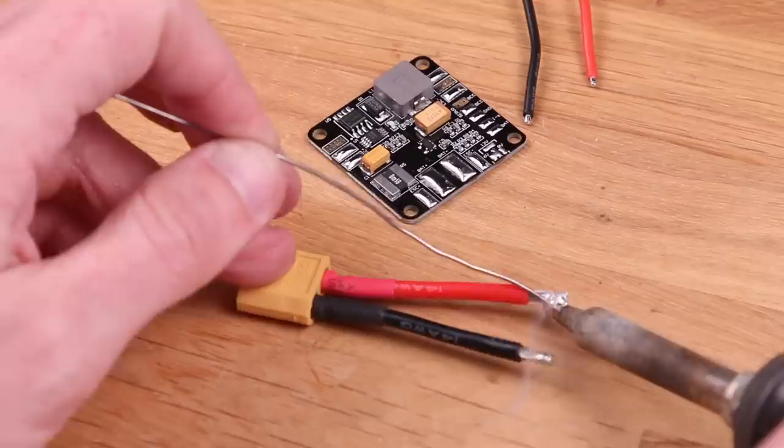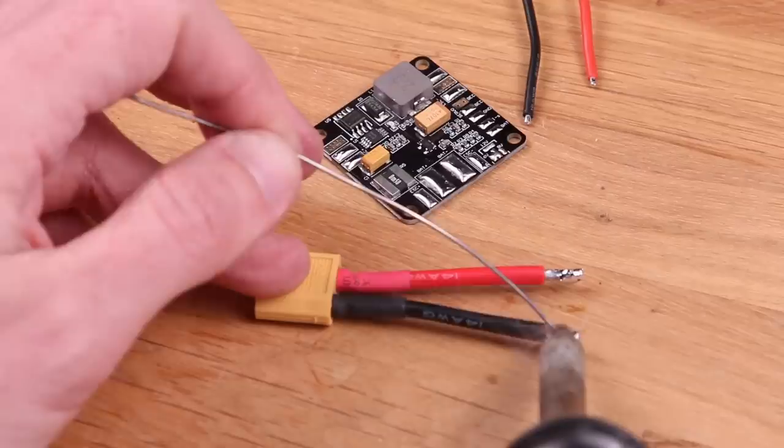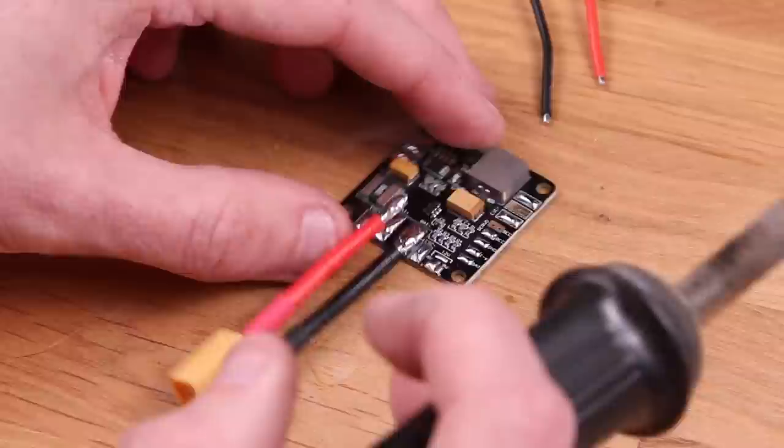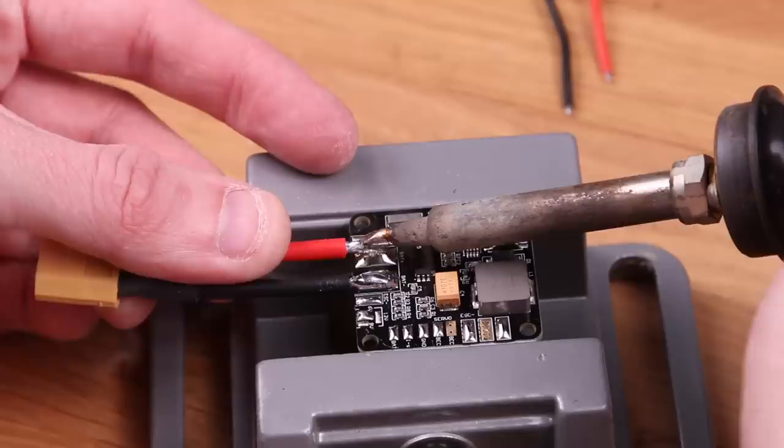If a cable comes pre-tinned from the factory, always heat it up and add a lot of your own solder. This is because the solder that they use in the factory is going to be lead-free, and that melts at a higher temperature, so you might get a cold solder joint. And when you solder that straight to a pad, you might be able to bury it, and it looks like it's soldered, but it's not.